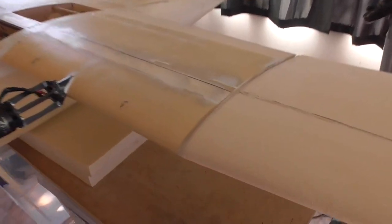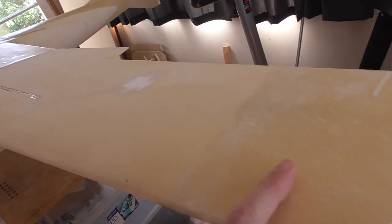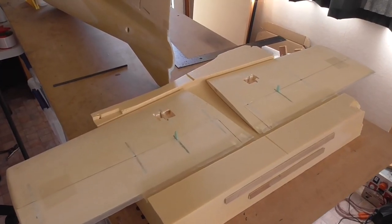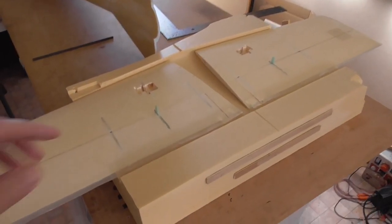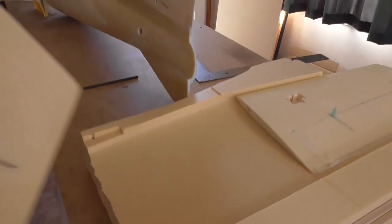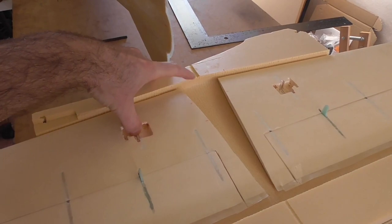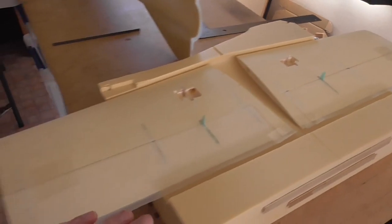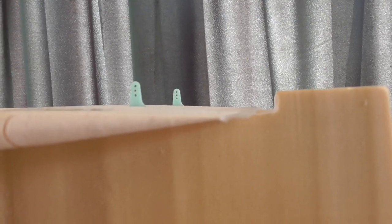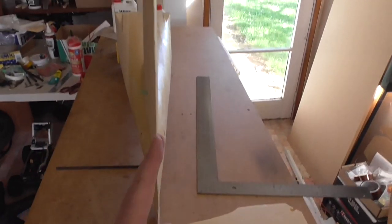I have glued those spar pieces into the outer wings, so there's no going back now. We've committed to that. At the end here I've put a little bit of glass just to make it easier - I'll be able to hold this while I'm glassing the rest of it. It's time to glue the horizontal stabilizer pieces onto the tail now, and to save myself some frustration I spent some time making this little jig on the CNC machine - it's just the negative or the bottom side of these, and that lets me place them in here so they'll be perfectly positioned relative to each other.